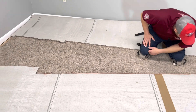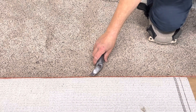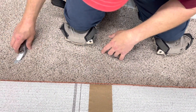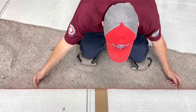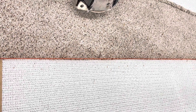You can see exactly where it did bow in just a little bit. It's very minimal. It started about right here and jumped back to normal about right here — it touched again at the edge of the seam, so it probably just didn't get pushed down quite the same. But it actually runs right beside it. From this point to this point it's got just an ever so slight bow — maybe three-sixteenths of an inch — between our string and the backing of the carpet. Everywhere else you can see it's right at the edge.